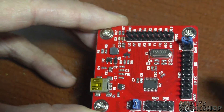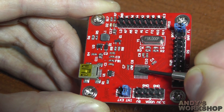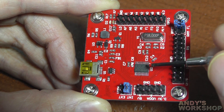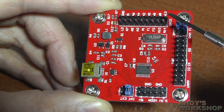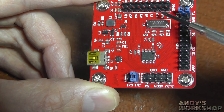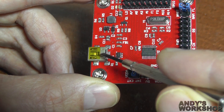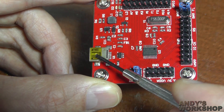So what have we got on here? We've got the MCU itself — the TSSOP-20 package, a 0.65mm pitch IC that's really easy to deal with if you're used to surface mount components. All of the GPIO available on it are broken out here. In addition to that, the USB lines, which are on PA9 and PA10 if I remember correctly, go out to the USB header here, which is also responsible for providing five volts in.